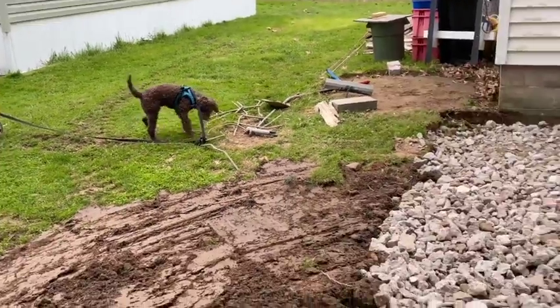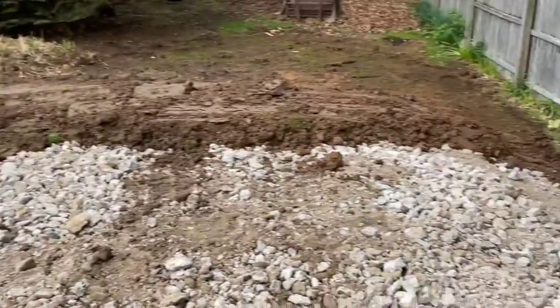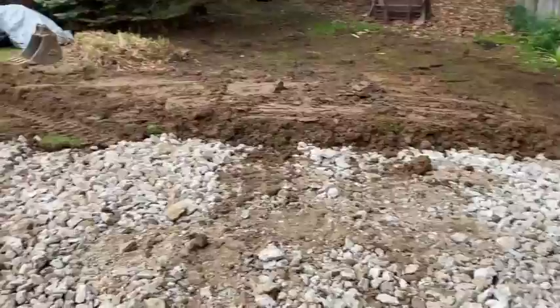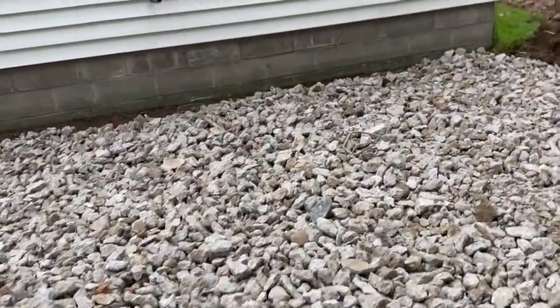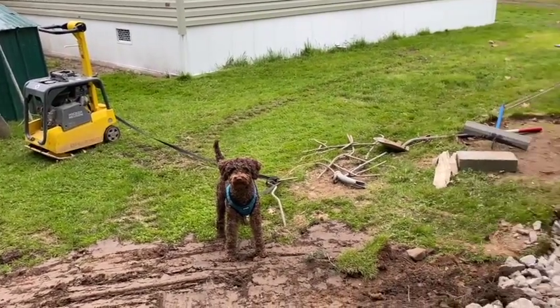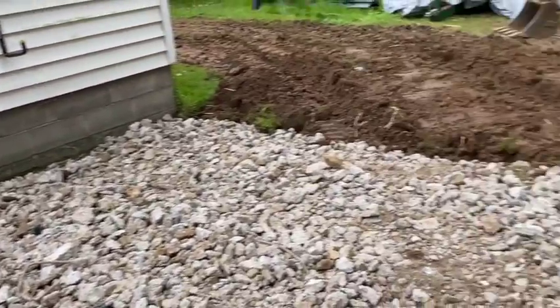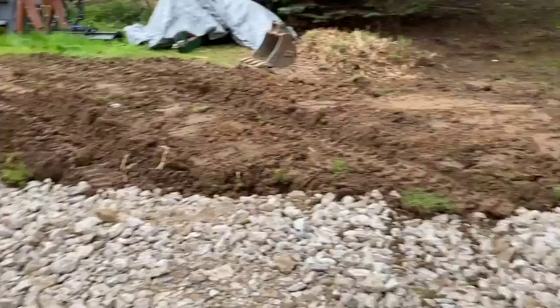Watch out for the rebar - there's some rebar pieces in this concrete because it's just crushed up recycled concrete. So now I'm going to put that item four in here, I'll show you what that looks like. We'll get it all tamped up - we got the big tamper. We'll get it all tamped and the boys are heading this way, and then we can form up our pad here.